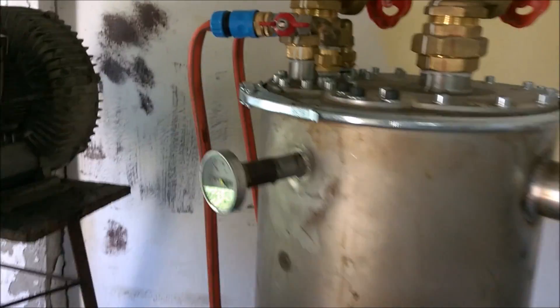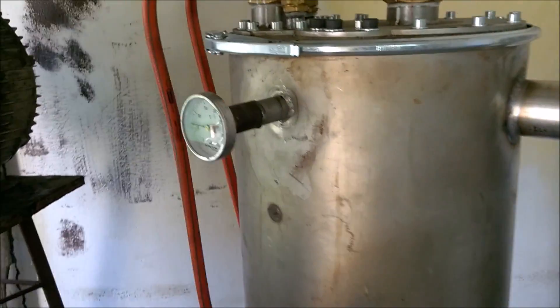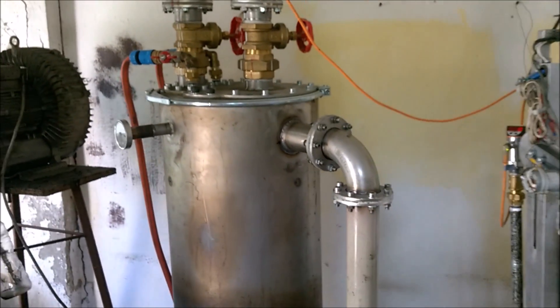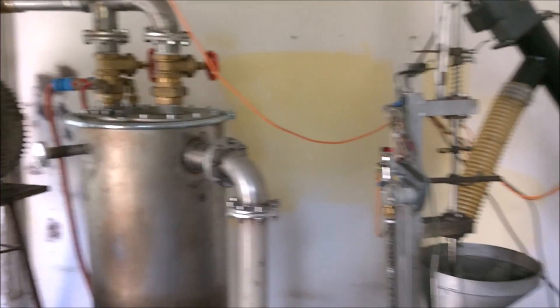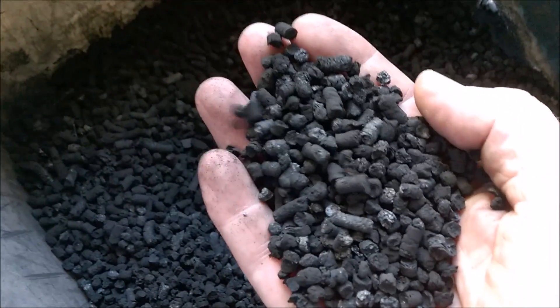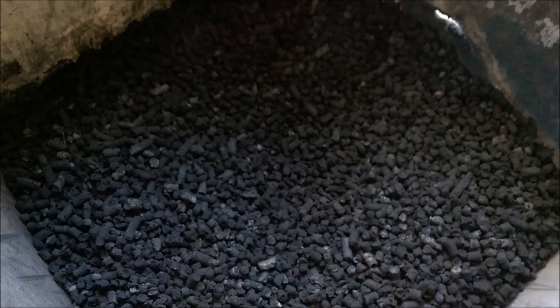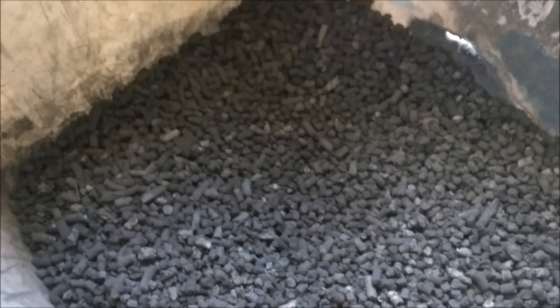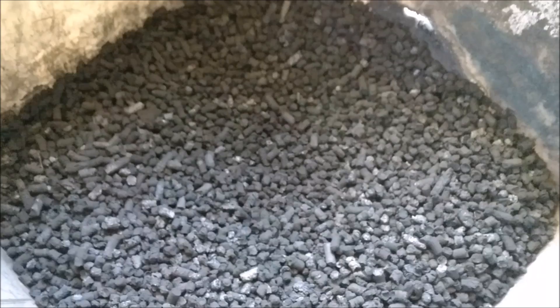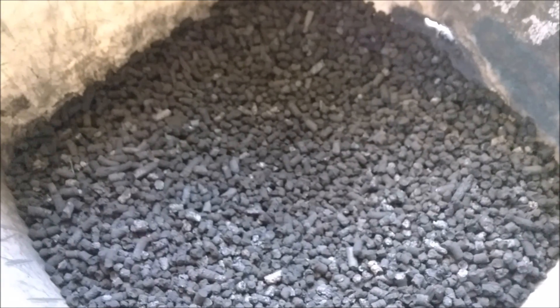In the condenser I still have cold and warm income. It would also be interesting to see how much energy I could harvest from this condenser. I have filled up the gasifier with gassed-out pellets — they are the remains from the last test — and I hope to fire as long as possible. This time without the water mantle, to see what the difference in gas quality is.